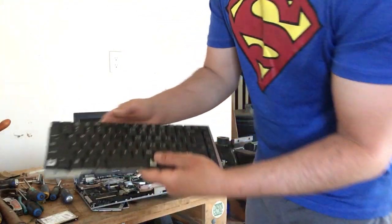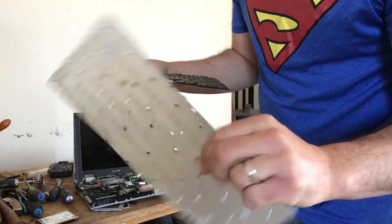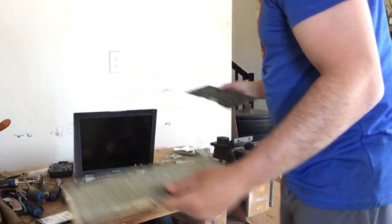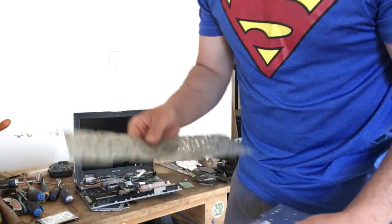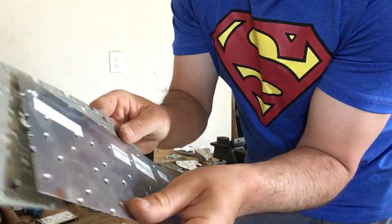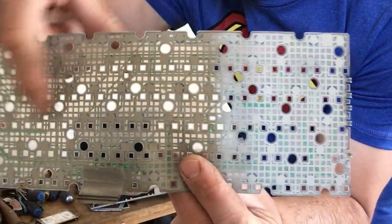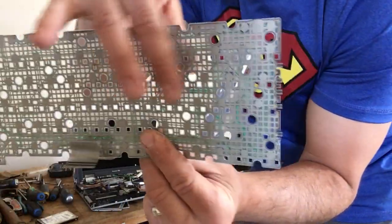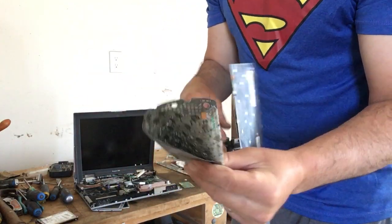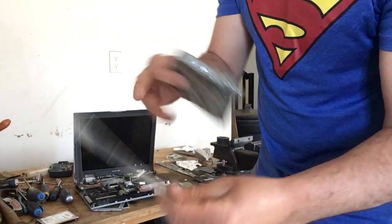Now I'm going to get into the keyboard. The keyboard is covered — I pried that off and it comes with a nice aluminum sheet. Where the push buttons are, this part is just garbage. I pry it off very easily in the corner with a knife. This is actually silver — there is silver going all the way through this circuit board. You can find these in microwaves and control panels. What I'll do is roll it up and once I hit my silver with nitric acid, I'm hoping it extracts the silver out of here. There's not much, but there is silver. And as I said, this is also a really nice piece of aluminum.